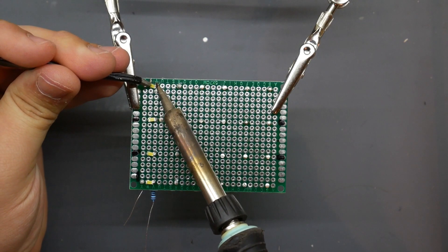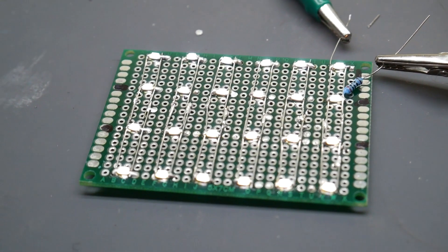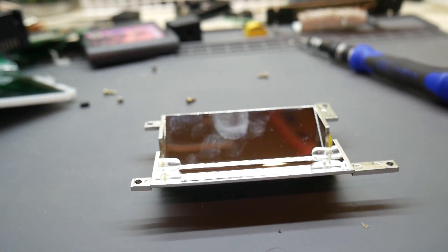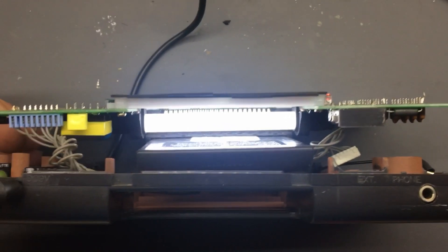I began thinking about the best alternative to the fluorescent tube. I first designed a small PCB with SMD LEDs to act as a backlight, thinking it would consume less power and be thinner, but I didn't consider how close the LEDs would be to the screen. Even with diffusers, there was no way to stop the LEDs from being visible through the screen without the assembly being larger than the original reflector. The next option was easier: I read that LEDs fit well in the holes in the reflector, meaning two white LEDs could replace the fluorescent tube. After installing them, the system drew around 130 milliamps, compared to the original 350 milliamps.